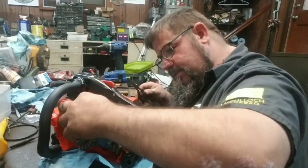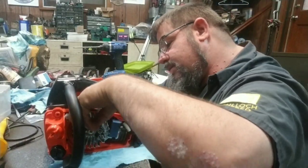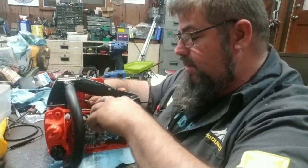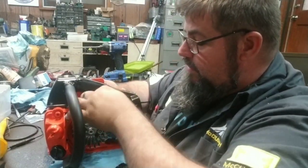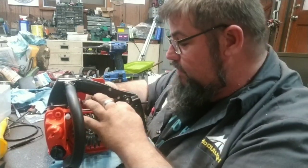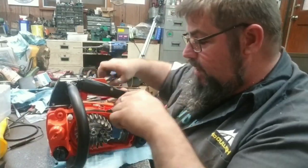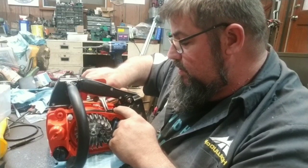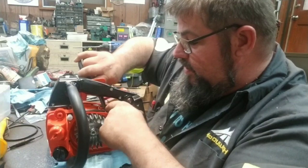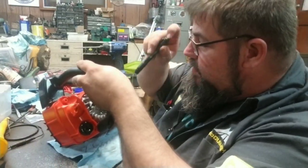Getting all these hoses back in line is imperative on these Echoes. I had one coming here for Poke but it didn't run right. He had me adjust on it. We couldn't get it to run right. And one day he just brought it over and he said, tear it down and find out what they did wrong, because the dealer had worked on it. And when I pulled it apart, they'd pinched the fuel line underneath the air box. And it was starving it for fuel. And I just put it back in there where it belonged and remedied the problem.